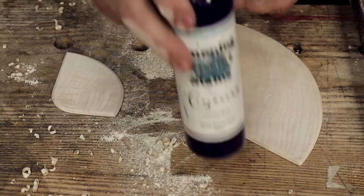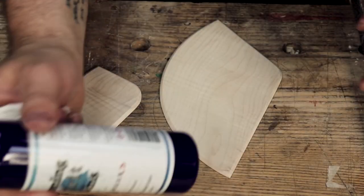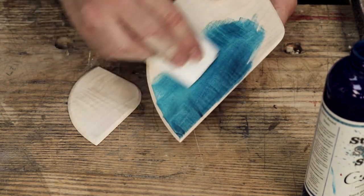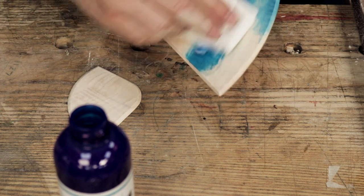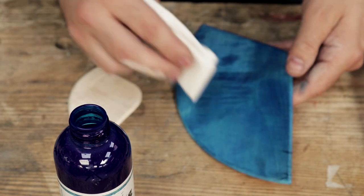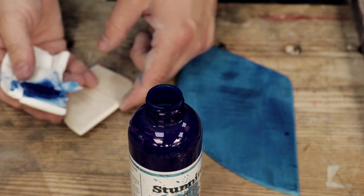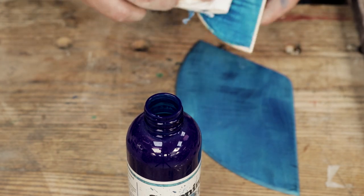Time for some staining. I've gone up to 320 grit paper, going for the same sort of effect that we had on the top of the guitar. And then I'm going to put some black over the top in the middle. In hindsight, what I should have done is put the black on first, let it dry, sanded it back a little bit. I just spilled a little bit.